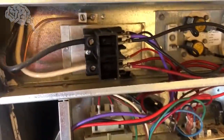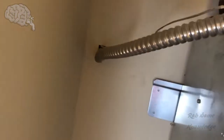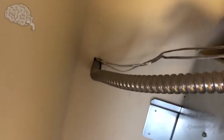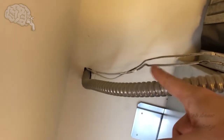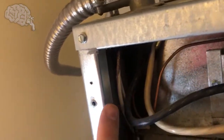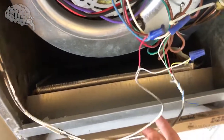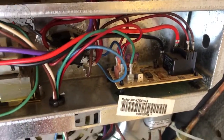Now that we've climbed up here we've got a nice close-up look. Here's the whole furnace unit. What we're going to do is find our C wire. Since we know we have one present, we need to find where it comes to and see if it's hooked up or not. We're going to find the two wires that come in through the wall — one going to the thermostat and one going to the AC compressor — they come in through the top and down through this hole, loop around, and come to a bunch of wire junctions that come from leads off of this board.